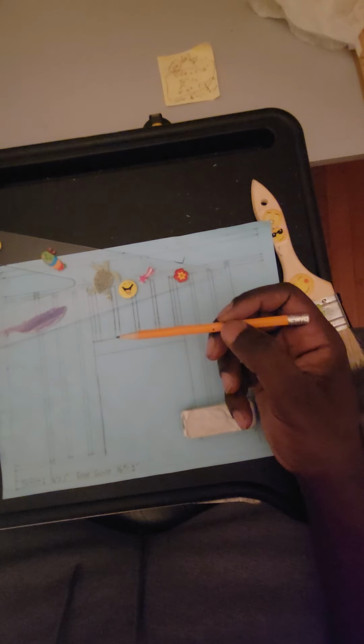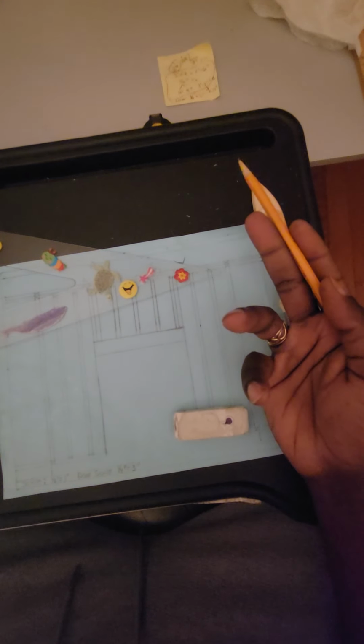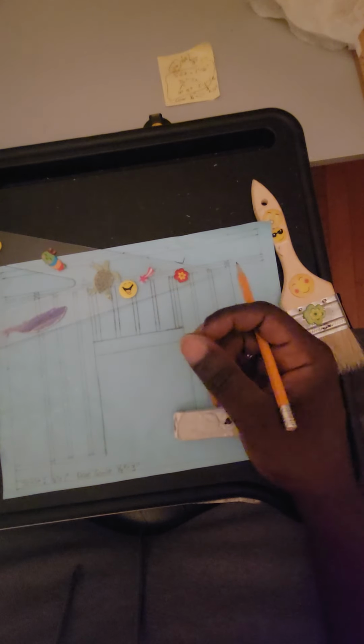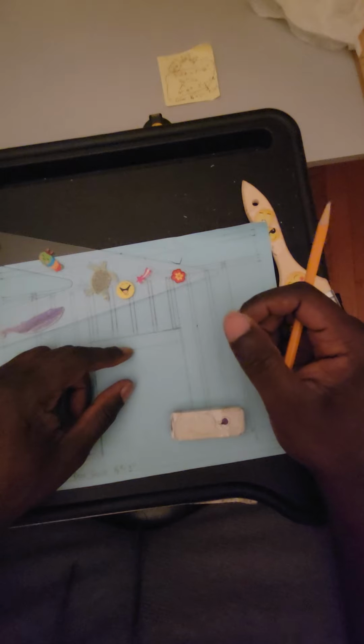You say, how is that possible, right? Well, 1.5 plus 1.5 is what? 3. Now you got that 1/2-inch in there. So if you put a 2x4 on flat, you get that 3.5 inches. Now it caps it. Now you have like a full-on box. Now you can set that in there. They'll do it at the top, and they'll do it at the bottom sometimes, just to give you a lip to hang on, something to hit onto.